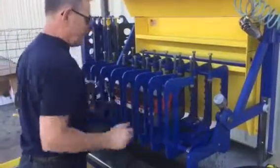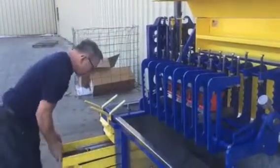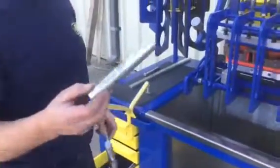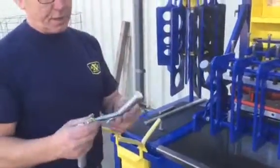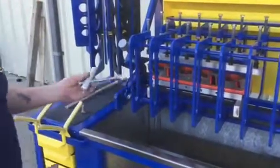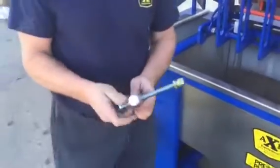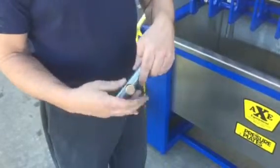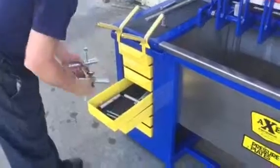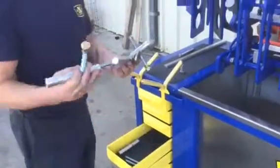Our next goal is to block off these water openings here. When you buy your pressure tester, you're going to get some tooling, and this is designed to go in between here, like so. I'm going to need 3 of them. You're going to have a bolt, a crossing clamp bar, and a toggle pad on the bottom of it. I'm going to use one that's a little wider. So I've got 3 of them here.